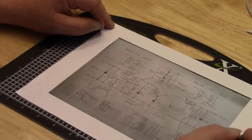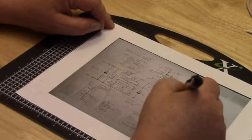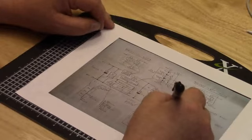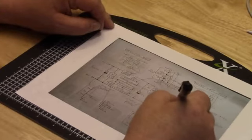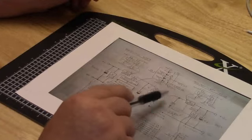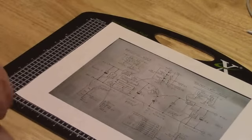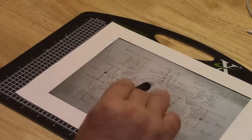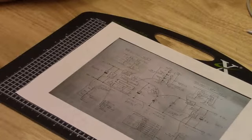But what I would have done, and I would have stuck it right here, is I would have used another 3,300 microfarad capacitor. Because when it comes through the gate and also comes through this choke, one of the problems that Julian had was a constant ring on that signal line. And by adding a capacitor in front of the current sensor and in front of the voltage divider, it would have smoothed all that out and kept it from jittering as much. So that's pretty much what I'll be doing.